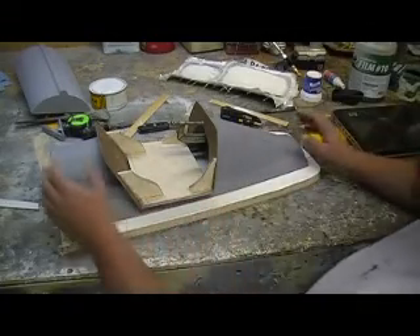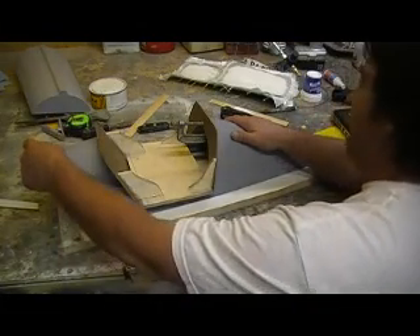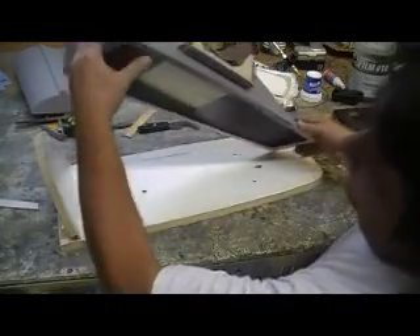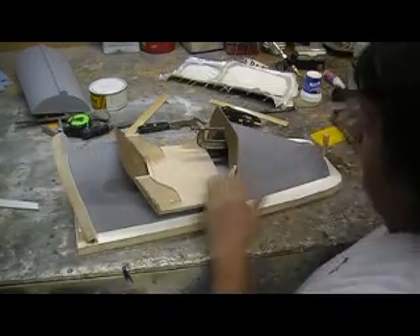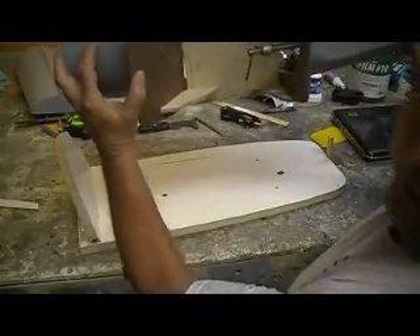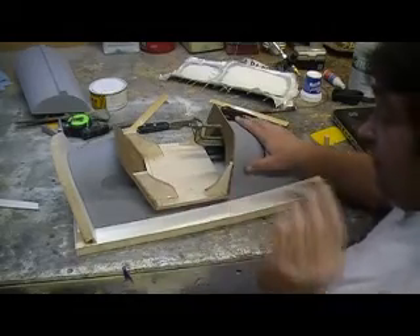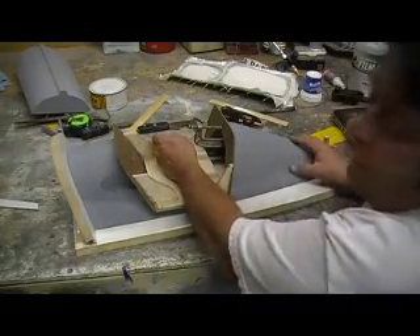Good and tight — that's my German word I know. I got that much done. Now this is all loose; we're going to fasten that down. I ain't got bottoms — got flanges. I'm going to fasten this down. I'm just going to drill through this wood right here. I already got some holes marked. I'm going to drill holes in there and I've got some big old long sheet rock screws — they're going to screw down into this wood and that's going to smash that down and hold it all in place. We hope.